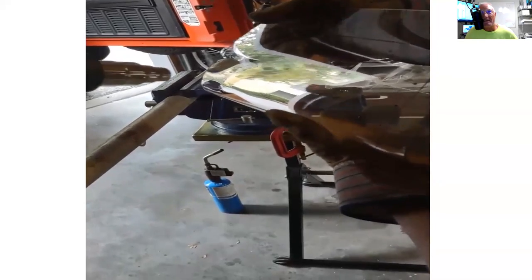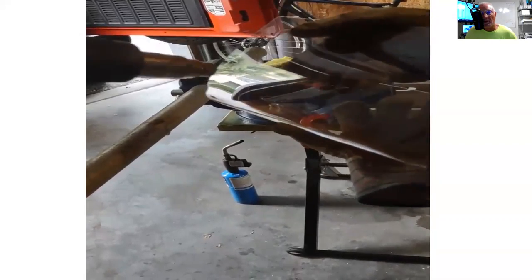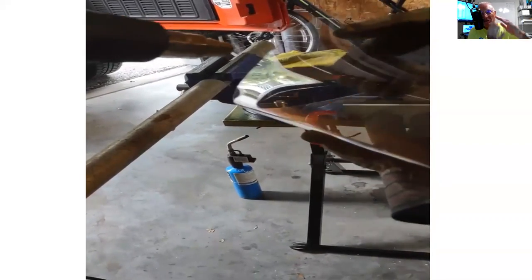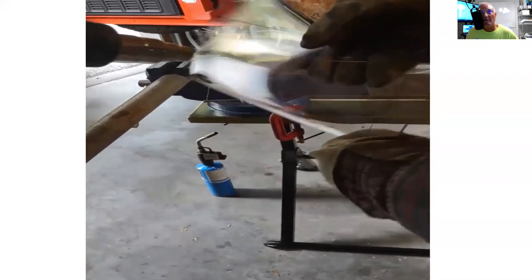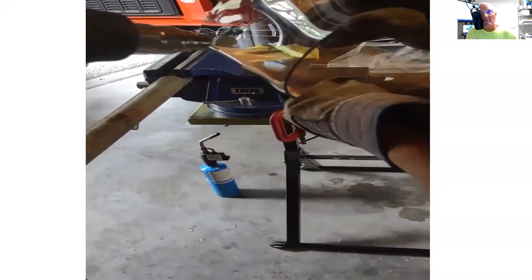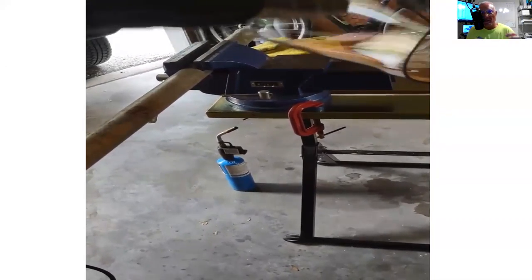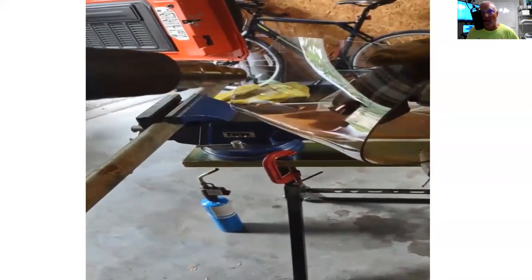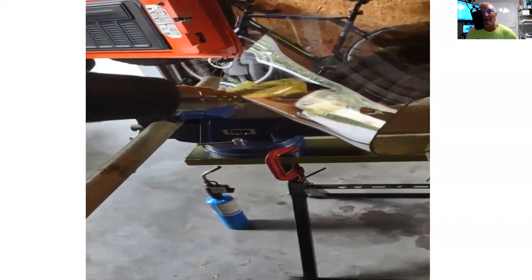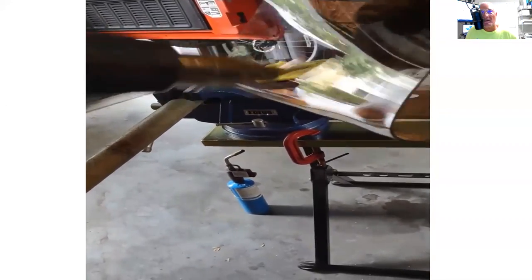Had to keep heating it to round it and avoid that point. You've got to be able to bend it around so that it doesn't get to a point. The leather gloves, absolutely had to have them. I mean, because you're using your fingers to move that, and it's 350, 400 degrees. Yeah, you can feel the heat.